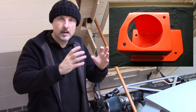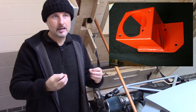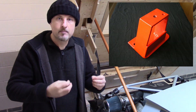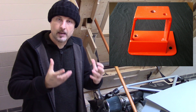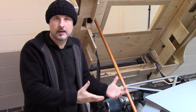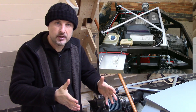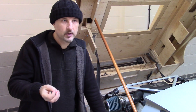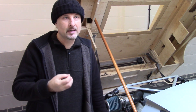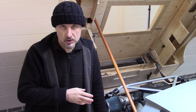The rest of the mount is made using stock material and can be assembled using 90-degree magnets, so no jigs are required to be made. Once the engine mounts were made, they are bolted into the chassis and then the engine and gearbox is dropped down onto these mounts. This was an experiment — I was toying with the idea of water jet cutting to make these mounts really cheap and easy to make. I may go back to this design and change it.